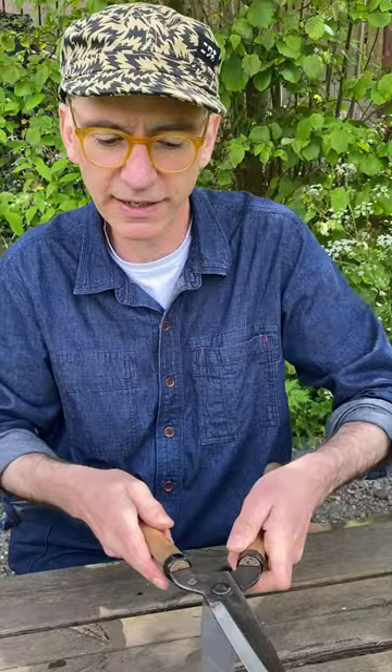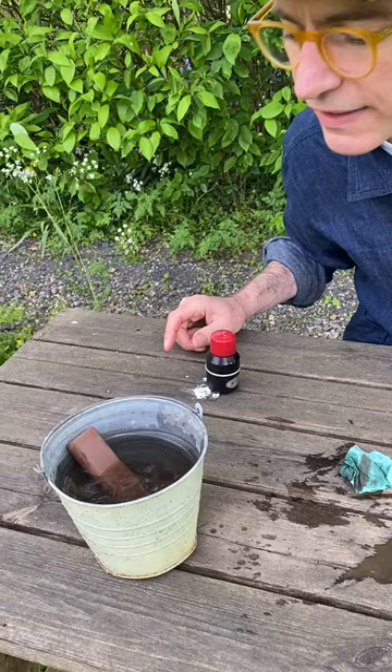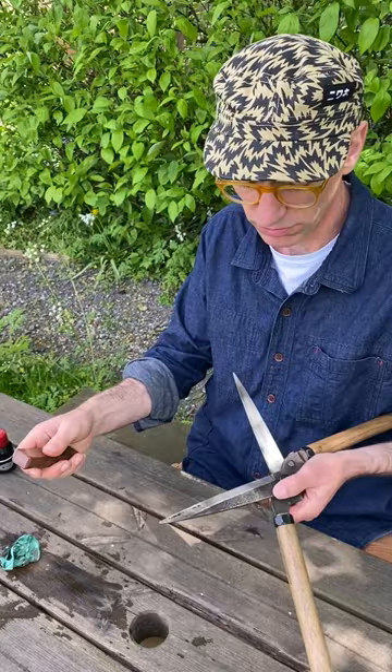That's clean enough — could always be cleaner, but certainly clean enough to use. The thousand-grit stone has had a couple of minutes soaking and the bubbles will have stopped rising, which means it's fully saturated. Take it out — I use warm water — and for shears like these with a straight blade, you want to use the flat outside edge of the stone.